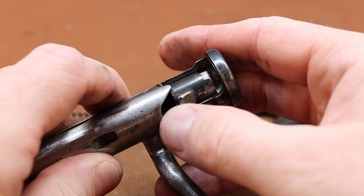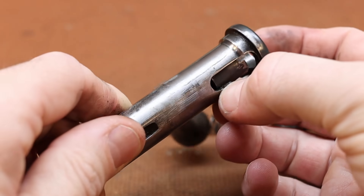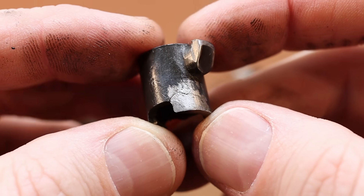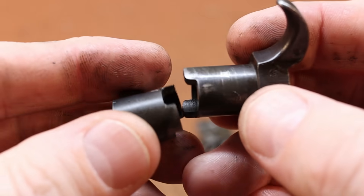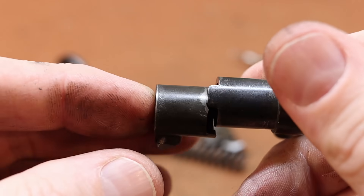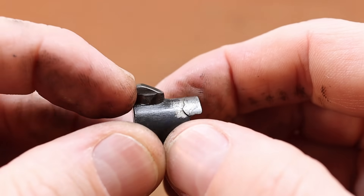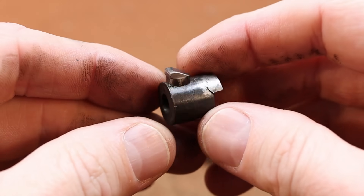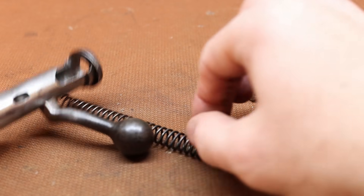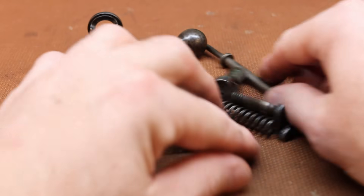Our bad part — you just drop it out the side. There's a better look at our crack. The back part with the hook on it — that's what made up the safety mechanism, and this is where your trigger sear sits. That crack is alarmingly close to that. So hopefully the part that comes in is a perfect match. I'll throw all of this stuff in the ultrasonic while I've got it apart. That's it for tonight — I'll see you guys after I've got the part in my hand.